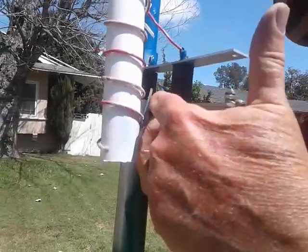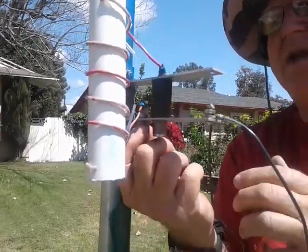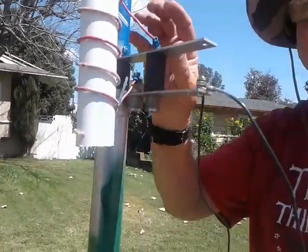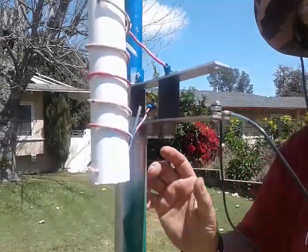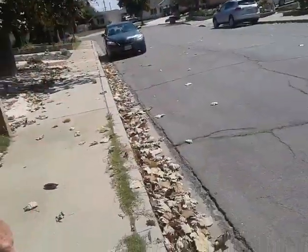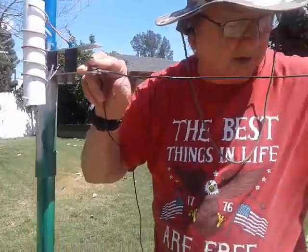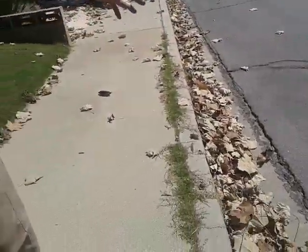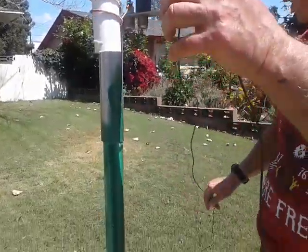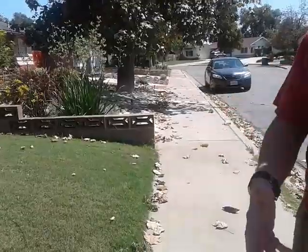We don't want to minimize the capacitance — we want some inductance here. That creates a 5/8 over 5/8. On other bands, it just sees this as an inductor and a long whip. To get that closer to 50 ohms, we add counterpoises for whatever band we want. By putting the 135 inches here, this counterpoise is good enough all the way down to 17 meters. For other bands, we want another one — in this case, I've got about 40 feet of wire on here.